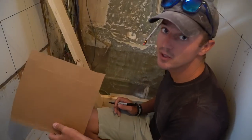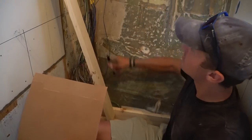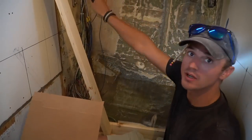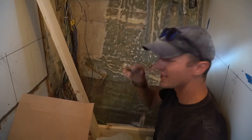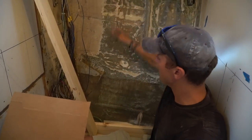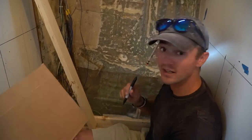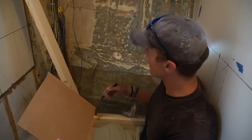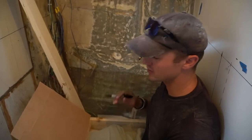So the next big piece of wood I've got to cut is going to be sort of a bulkhead that goes in here that'll separate the wet locker from the sink and the cabinetry above it. It's kind of a tricky thing to cut because of this compound curve of the hull. So I'll walk you through the steps that I'm going to take, and hopefully it makes sense to mark and measure out that rough curve so that when I cut it onto a template, it should fit the first time.